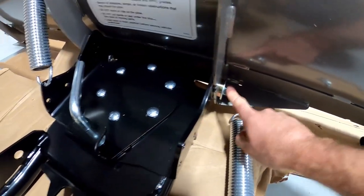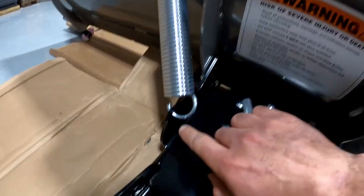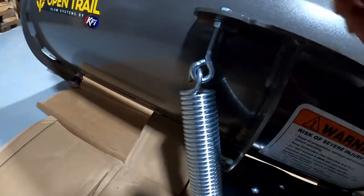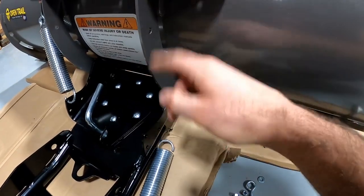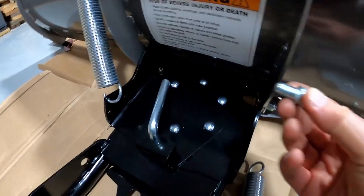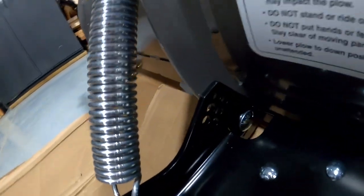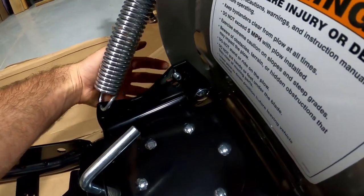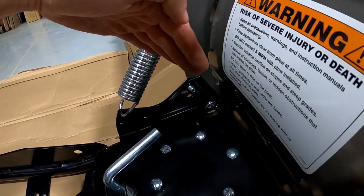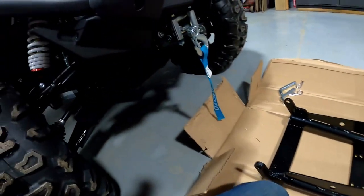We've got the other mounting bolt on the push tube and installed our winch bracket that's going to raise and lower the push tube. Here's an example of the trip spring — it goes in the hole here, and up top we have the eye bolt with a nut and washer on the bottom and a nut and washer on top. Once both are installed, this top nut determines the angle of the blade when it's on the machine. As I push out on this you can see those holes opening. I'll set the depth with this nut — right there looks like a good angle for this machine — put the nut on the backside so the blade can't tip back any farther. The springs are going to keep the tension on it. Then we'll come back to do the mount on the bottom of the Z-Force.